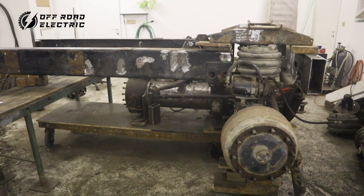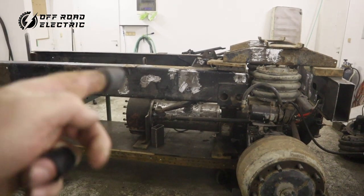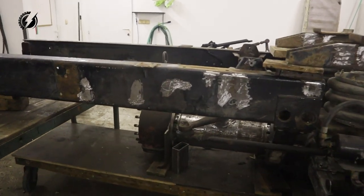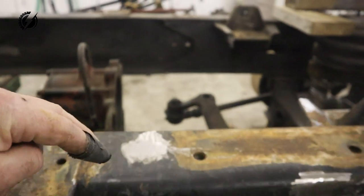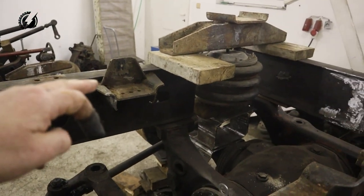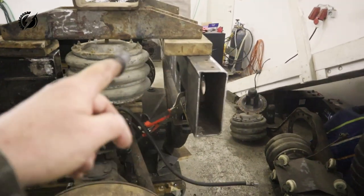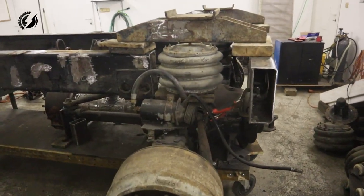I want to give you some explanation, guys. We are going to cut the rails somewhere, probably behind the T-case. It depends how it will be attached to the midsection with the battery. And we are going to probably attach it to this plate over here, plus make some cross member for the rigidity here. Mounting points for the Tatra motor we might use for the Tesla motor. Over here, into this gap, we are going to put this shock. It'll be a tight fit, but it will fit.